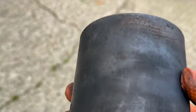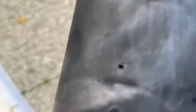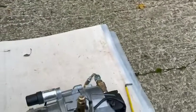I'm going to bring your attention to the blast tube. When you put a blast tube on, you've got a hole - the hole goes at the bottom, facing downwards on the burner. If you get nozzle dribble, it comes out the hole. If you have it the other way around with no hole facing down, it can just build up at the bottom sometimes, which isn't ideal. It's better to let it drip out - that's why they do it. So hole at the bottom, it goes on that way around. Simple.